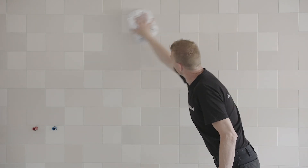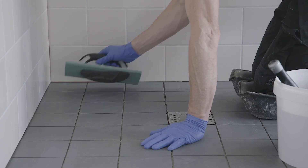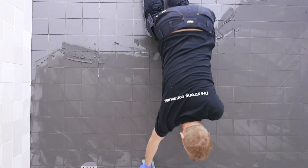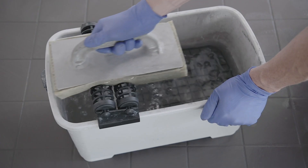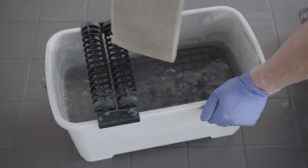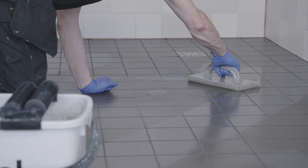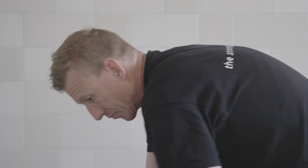If a cement sheen can still be seen after drying, remove it with a clean and dry cloth. Grout the floor in exactly the same way as the walls. To clean it you can use a sponge board and sponge tray, which often works better on large surfaces. Make sure you dry roll the sponge board enough to prevent the top of the joint from becoming separated. Also sponge the grouting on the floor one more time by going over all the joints with a damp sponge — this ensures a more even dark joint colour.